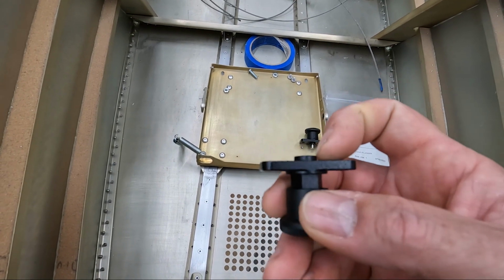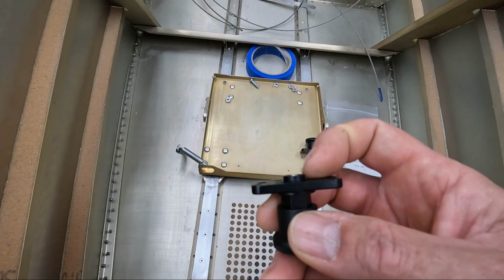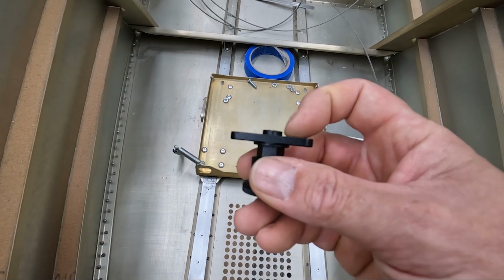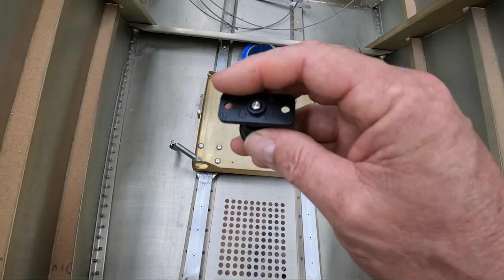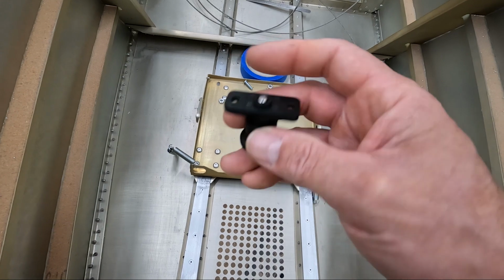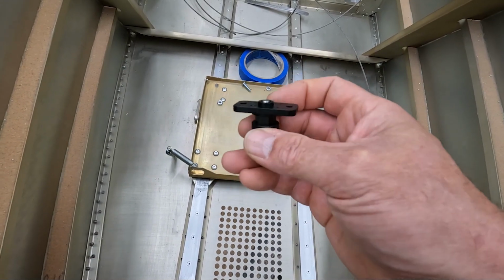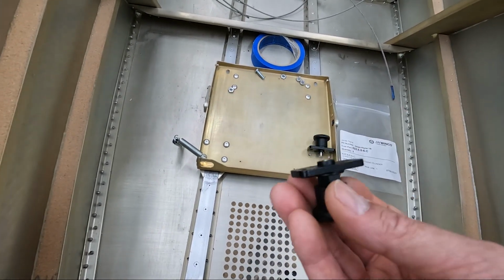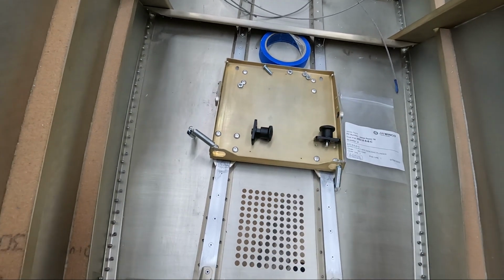What I'm going to do is, that lip is about, let me see, it's 2.5 millimeters, so it's like 0.1 inches. And so what I think I'm going to do is get some 63 thousandths material, and make a piece that's the shape of the base of this. We'll drill a hole in the middle and drill the holes for the screws, and I'll use that as a washer or shim plate to go underneath this so that I can screw this in here, and that won't be sticking down through the bottom of the rudder pedal tray.